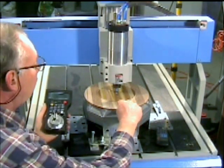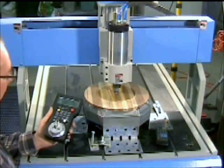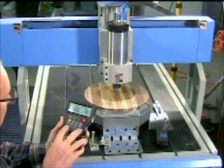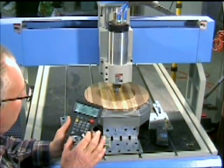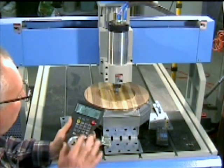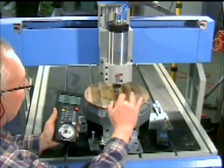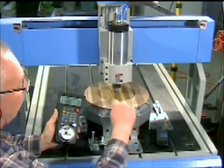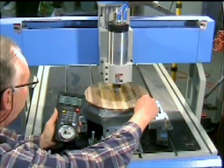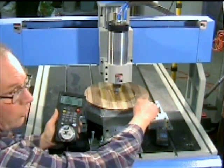I did that to be able to find the center to put the face plate for the lathe on there. So I'm just centering the X and Y at the moment. Because this is slightly raised here, I'm going to manually machine this off to the same height as the rest. And then I shall zero the Z axis off to the one side here.